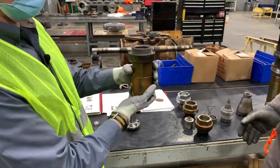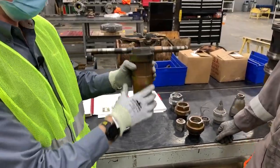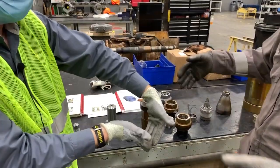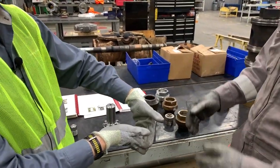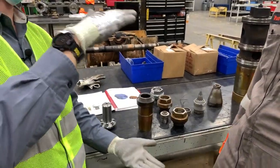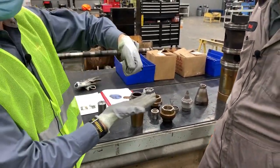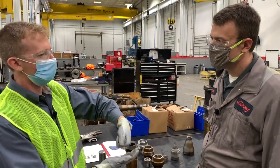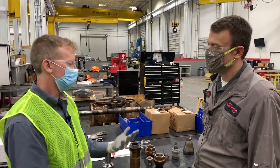This assembly actually has a slight angle to it. The two inward-facing jets actually come together — they converge approximately 6 to 8 feet below the cutting tool. That's where you get the maximum cutting power. So if you're putting that water directly on the surface of the coke bed, you're not using the tool properly and you're not getting the most efficiency out of it.